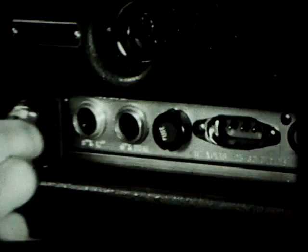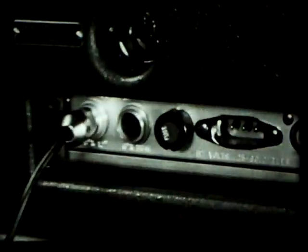Your projector may have its speaker in a separate case. If so, the speaker requires manual attachment of its cable at the speaker end as well as at the projector. Note that the separate case speakers plug into the first receptacle at the left of the oblong panel instead of the second.